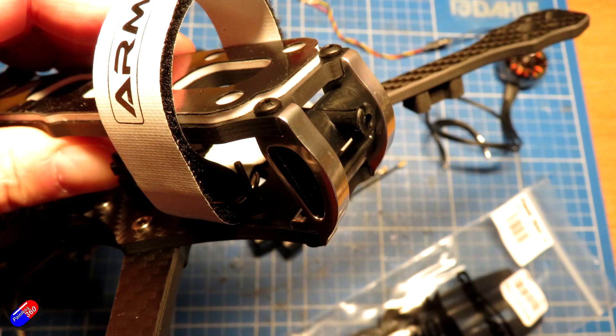I'm not really too worried about that — I'm sure I've got something I can use. In terms of the GPS, I'm almost certainly going to use a modern M10-based GPS with an external compass in it as well. But to actually mount that, I'm probably going to have to 3D design something to go at the back of the quad.